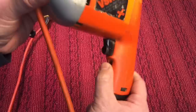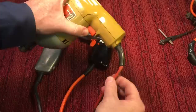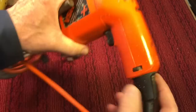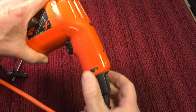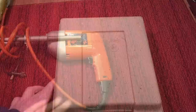One common weakness you're always going to find with quarter-inch drills is the strain relief — it's supposed to stop the cord from bending sharply, giving it a gradual bend instead. But they tend to fail there, and that's where cords always became a problem. Black and Decker recognized that for a short time and came out with a design where on the back of the plug there's a little double-sided switch — you turn it, give it a click, and the plug pulls right out so you can replace just the cord. It was a great idea, but it only ran for a couple of years.